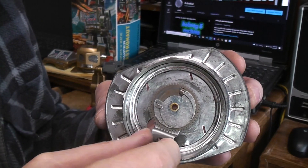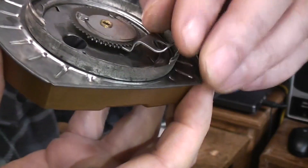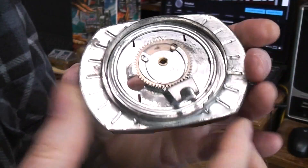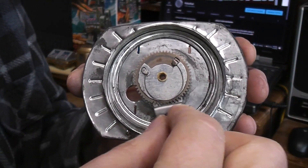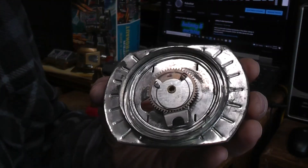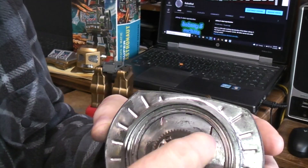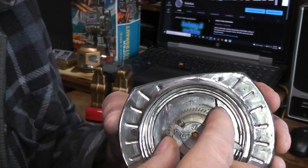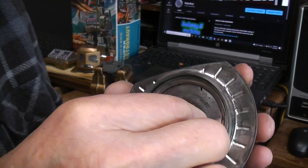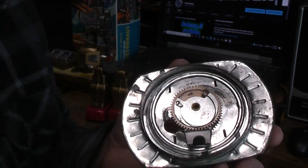So this door mechanism has opened. It will sometimes chatter at the end — they only put so many teeth on that gear. You can see over the end right there it gets to the last one and it'll sit there and chatter and wear the brass gear out. It's not designed for long life. As this runs out of space, that chattering will stop because now the gear has engaged this piece and this can't turn any farther. This piece is connected to this piece, so that's when the body starts rotating — because the only place left for the energy to go is to make the whole thing rotate.